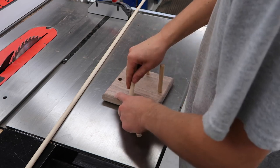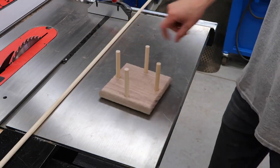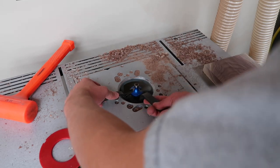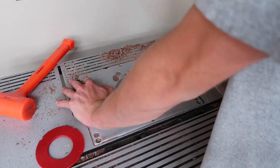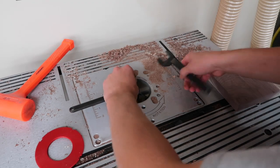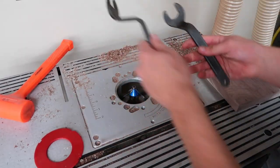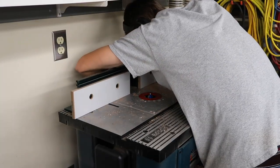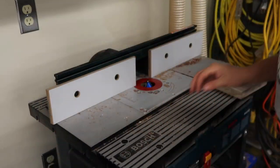That's how I make these little coaster stands. For the next one it's the same process so I'm going to skip through it quickly. I'm grabbing another piece of scrap and cutting it into a six-by-six square, but this time instead of a round-over I'm going to put a chamfer on it, so I'll change the bit on my router table from a round-over to a chamfer bit and chamfer the bottom of the board. One thing you should always remember when changing bits on a router table is to unplug the machine — you definitely don't want it starting up accidentally. I also put the fence back on so I can attach the dust hose and not make as much of a mess.